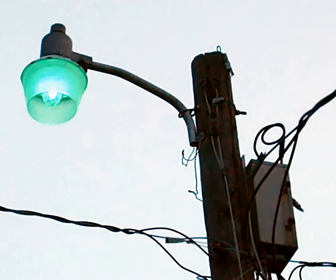Clear mercury lamps produce white light with a bluish-green tint due to mercury's combination of spectral lines. This is not flattering to human skin color, so such lamps are typically not used in retail stores. Color-corrected mercury bulbs overcome this problem with a phosphor on the inside of the outer bulb that emits white light, offering better color rendition. They operate at an internal pressure of around 1 atmosphere and require special fixtures, as well as an electrical ballast. They also require a warm-up period of 4 to 7 minutes to reach full light output. Mercury vapor lamps are becoming obsolete due to the higher efficiency and better color balance of metal halide lamps.